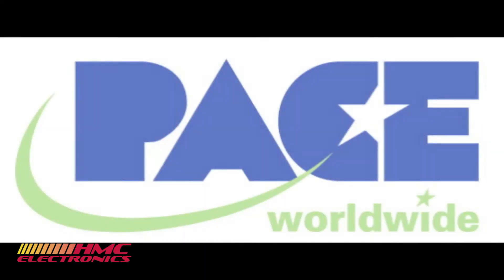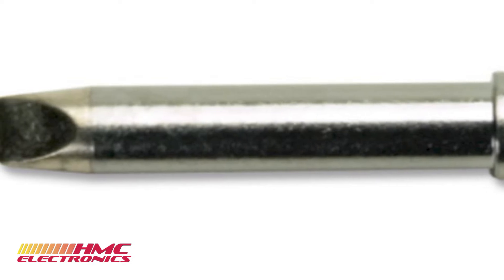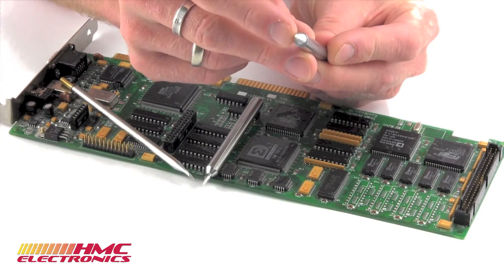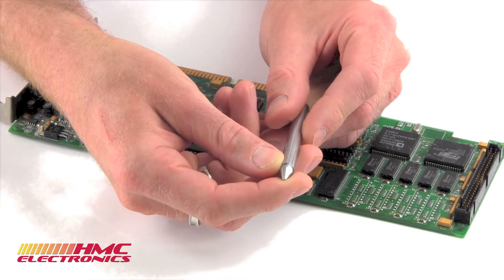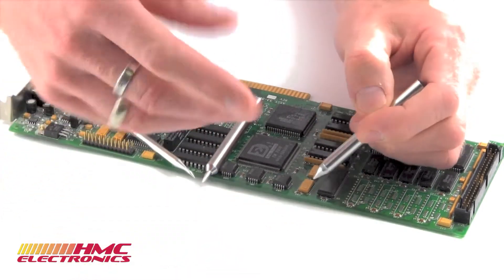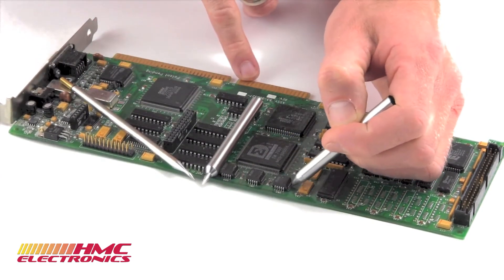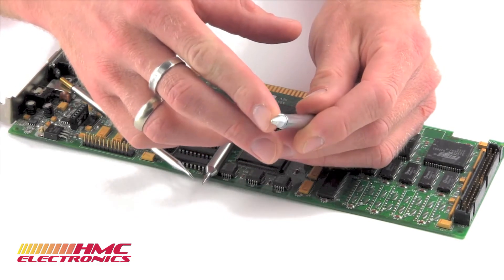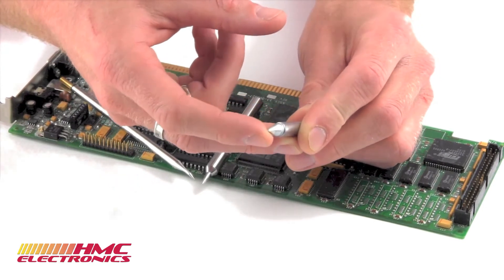Let's start with the most common tip configuration — this is called a chisel. And if you look very closely at the tip, it looks like a screwdriver. Why is it common? Because it's thick here, you get a nice thermal mass and a nice thermal transfer. This thickness means that the tip is both durable, and over the life of a soldering joint or the time you're trying to get heat transfer from the tip to the lead, you've got this nice mass which means the tip is quick to recover.